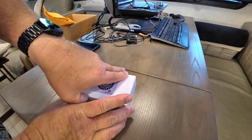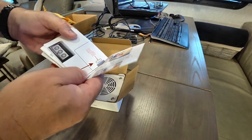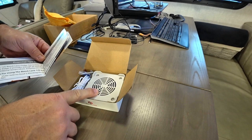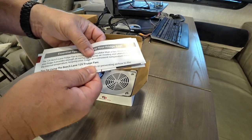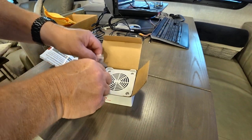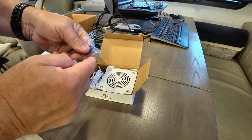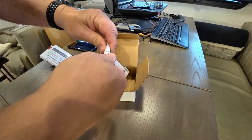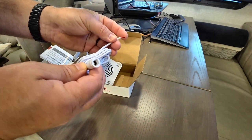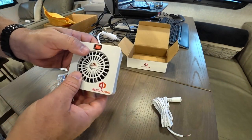So let me show you the fan. This small one is to replace that battery-powered cube. They give you instructions — there are actually three different things here. The good news is this company is based out of the US. You've got Americans writing the instructions and explaining all this to you. They have a lifetime warranty, so if you have any issues, contact them. They're going to give you some wire nuts — these are so whenever you clip your 12-volt wires you can twist onto them and reconnect. You also have this cable here, which is long and plentiful in case you want to go to the back. It does have what they call a barrel connector so you can run your wiring, do all your connections, and then just plug it in.